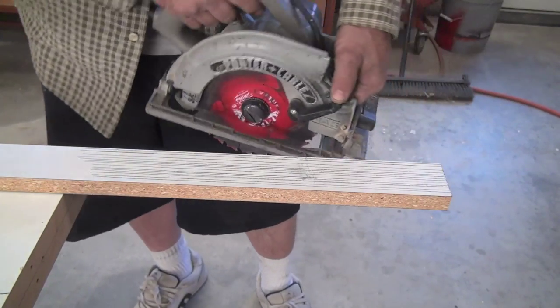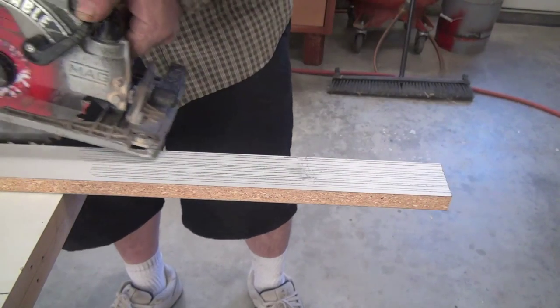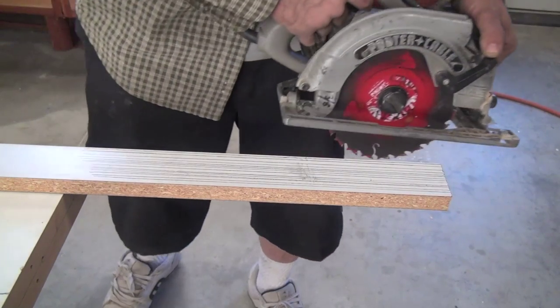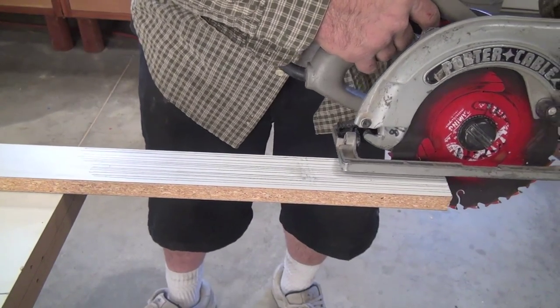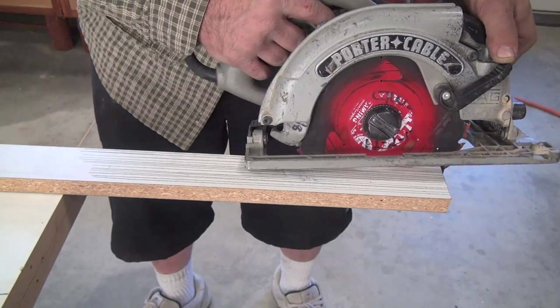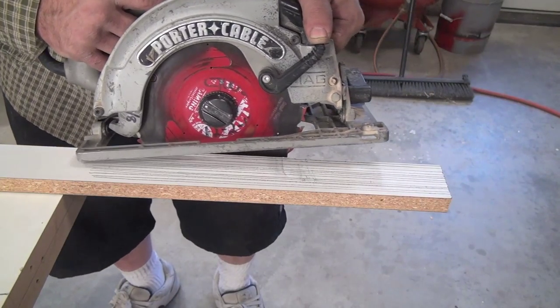If you're taking off several inches, you run your skill saw going forward first, take it down to within a half inch, and then go backwards for the final pass. When you finally get there, you go backwards like this — we're not worried about being at a 90 right now, we're putting a little angle on it. Twist the back portion slightly, an eighth of an inch, and continue going down.